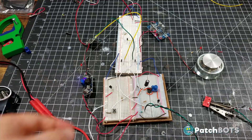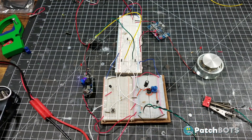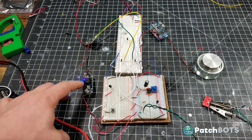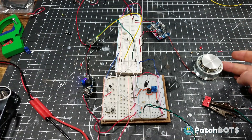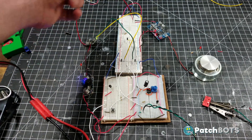Okay so here's our circuit. I know what you're thinking — why would he put this on three separate breadboards? When I started setting this up my goal was to make it very visually easy to follow, which as I started adding components quickly became not the case. On this breadboard we have our single shot input, on this breadboard we have our multi-shot circuit, and up here is basically our light. Here is a buck converter taking our 12 volts down to five. Here is our Adafruit sound trigger, this is our amplifier, and here is our transducer. The way the circuit works is the switches are connected to ground, and when I activate the switch it sends ground to two places: one, it grounds one of these pins on the sound trigger which makes the sound go to the speaker, and the other ground goes to the base of this transistor which sends power to the rest of the circuit for the light.